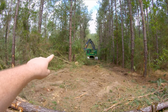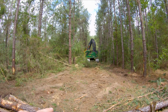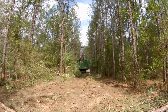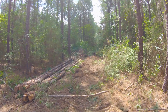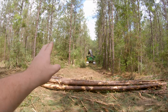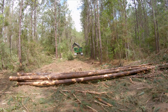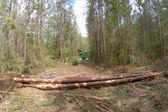That boom goes in and out of those middles a lot faster than you can drive — especially over these beds, way faster than you can drive a rubber tire cutter in and out. It can also get in a lot tighter situation. The side of that head just tucks up real nice and tight. You can do less damage to the trees and do a better tree selection process with the track cutter. So we do our down rows first with the rubber tire, then come down here and thin with the track cutter. Unless we don't have the rubber tire going — then the track cutter will down-row it and thin his left side going in and right side coming out.